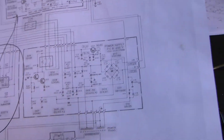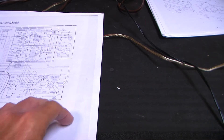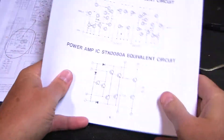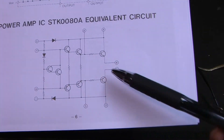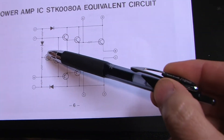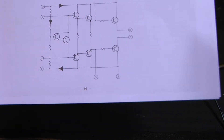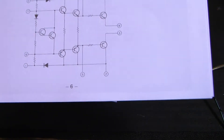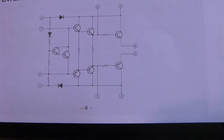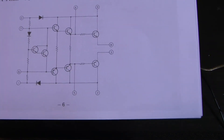So in essence, from there we go to the meters and the LEDs. I also found the equivalent circuit for the Darlington pair ICs — that's a Darlington pair right there: just two transistors connected emitter-to-base, emitter-to-base, which multiplies the gain. The gain of one transistor multiplied by the gain of the second — it's a way to increase the current gain, not the voltage gain, to supply that final oomph of current you need to drive speakers.